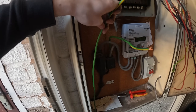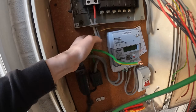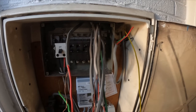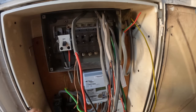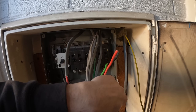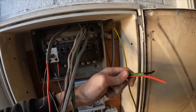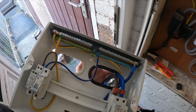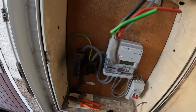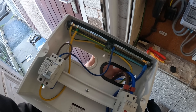I can wire that straight into there — you can see the mother earth cables going in. I can pull that one back, take it out, and bring it into the fuse board, swapping it with the other one, rather than putting another joint in because you're not really meant to extend bonding cables. Also, the shower has been disconnected — I'm going to bring it through into the new board so that if they ever want a 32-amp 6mm supply to the bathroom it's easily wired in. We've got 25mm new tails using the tails gland, the new 16mm earth, and the 10mm bonding going to the gas and water — I've gone straight into the main head rather than extending it.